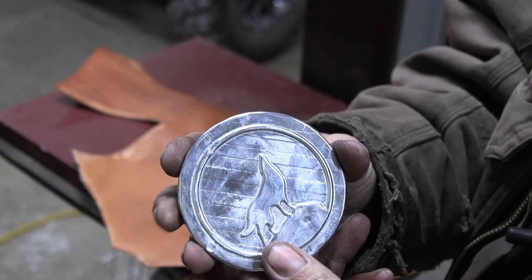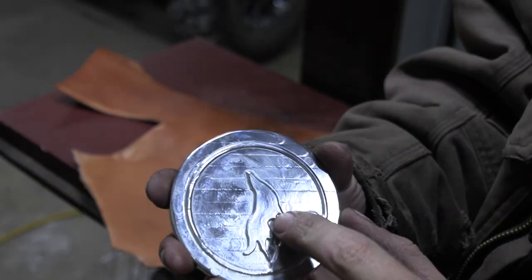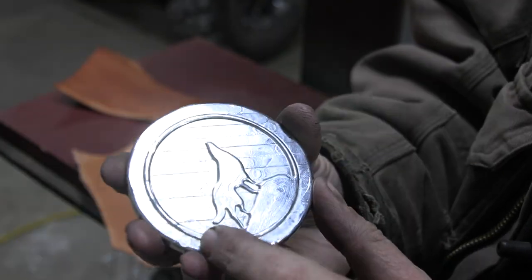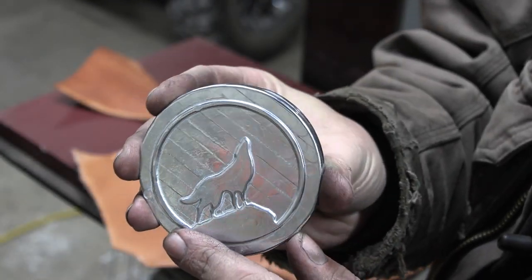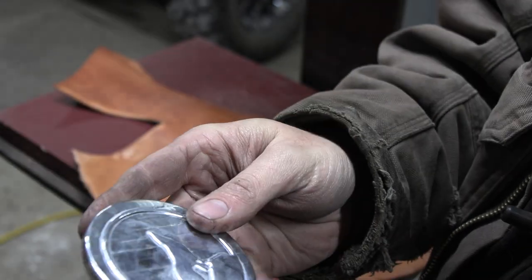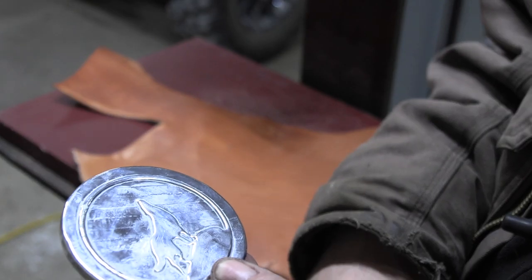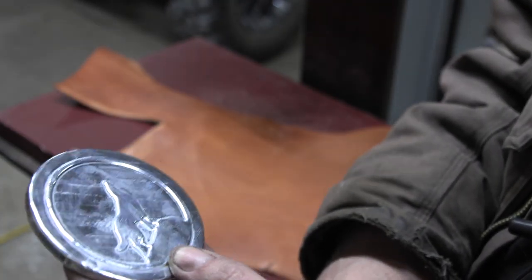Still not sure I like how these came out. They did take a lot of detail. You can see all the marks from the graphite mold where it was milled, which is kind of impressive. But it kind of rounded out all the edges. It didn't fill into the corners, so I think it's going to be a little bit off on the impressions.